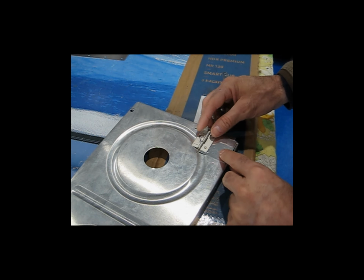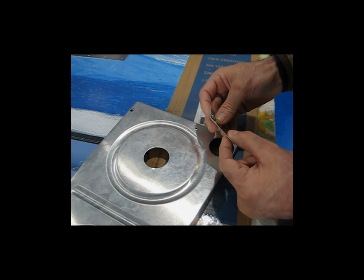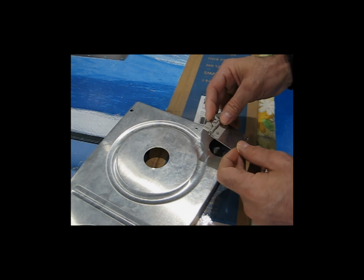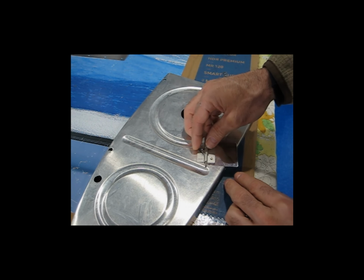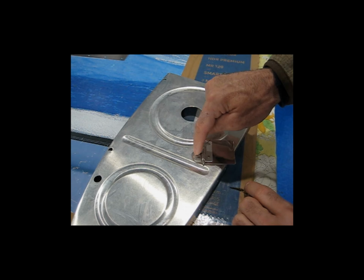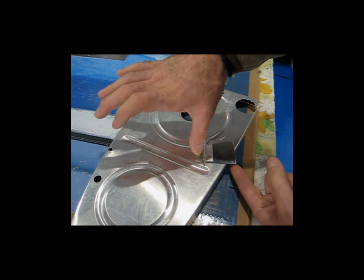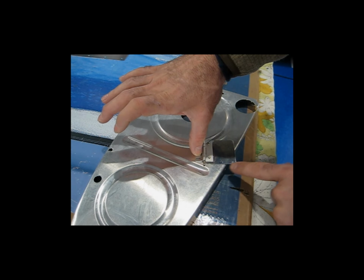Another thing I wanted to point out, and again, it's not really that big of a deal, but you have this material of the door underneath this hinge. So, I don't know if I can demonstrate this very well. Let me see. So if this is laying on a flat surface, in theory, since you have this thickness of material under the hinge, you should have that same thickness of material under this side of the hinge as well, because when you rivet this down, that's going to make this lift up. And of course, now you have a leak point underneath.